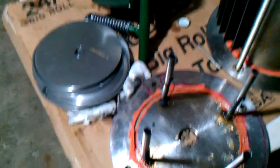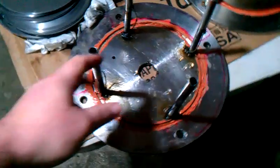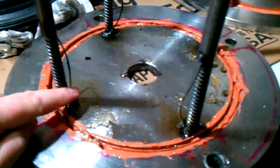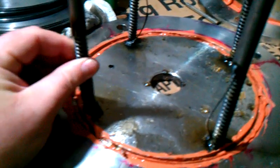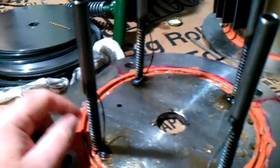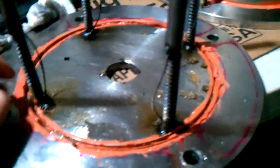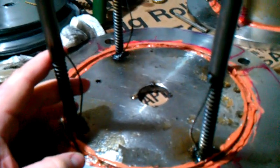Looks like I just got to do a little bit of drilling and grinding. I'm going to take this system off — this was actually holding the discs in place. As you can see, they're spring loaded; that was holding the stationary discs compressed against the spring, or the shims themselves. I'm going to eliminate this. I've come up with a new design. These were semi-failing — after a while, when this got up to temperature, these springs would weaken and the actual pressure would decrease to the point where it would allow them to slip momentarily, enough to where I didn't like it. So I'm going to remove this entire system and make the hold-down pressure adjustable from the outside. I'll show all that when I get that done.